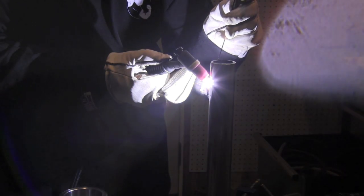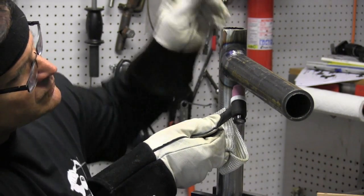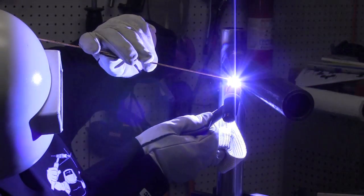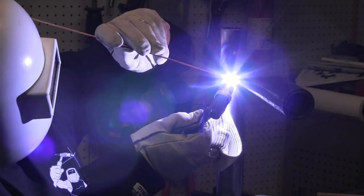This is just one way of doing things — there are guys out there making way better looking welds with their own techniques. This is the first pass. We're going to come over this thing with a second pass, and that's a benefit of using a gas lens and getting good shielding — you've got a little bit of luster on the first pass because that second pass certainly goes in better if the first pass is shielded really nicely. The less oxidation the better when you're welding a second pass over top. A good wire brushing also helps.